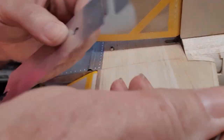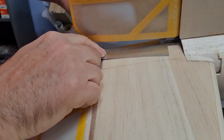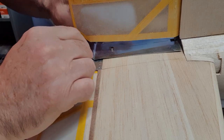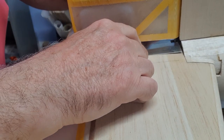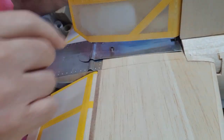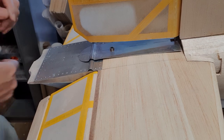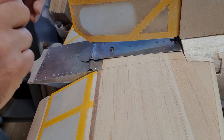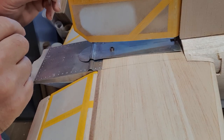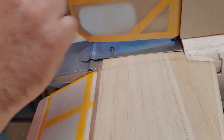Right, just to do the last bit, I've got a cone-shaped tape Permagrit. Goes over that like that, and then it all aligns up on the center line. So that's good. So now I need to just check my drawings. And there are screw holes all the way around the edge of this. So I'm going to check my photographs and mark where those screw holes are going to be, and then drill holes in the litho plate at those points to add simulated screws.